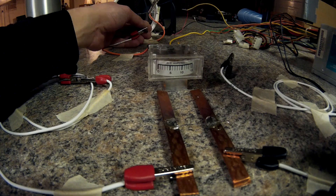The table is probably damn hot too. After seeing this, I'm not going to be using any speaker wire, and I'm probably not going to use resistors. So I'm going to do some research and see if I can't find some actual fuse wire that will blow smaller than 5 amps. I'm looking for something where if the cell is going bad and starts to pull 2 amps, it will pop that fuse. I don't want the packs to come down — I want to keep these batteries going as long as I possibly can. So 2 amps is my cutoff. I won't make an actual pack until I have 2 amp wire in my hands and can test it.